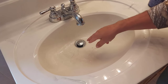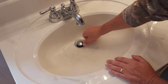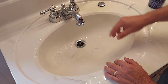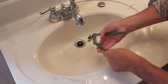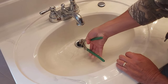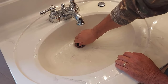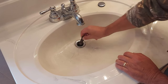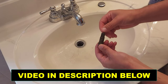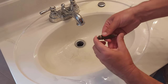Now with those methods I showed you how to unstick this pop-up drain stopper — it should work. Once you get it up, don't stop here because it's just going to keep happening. What I want you to do is turn this off — turn counterclockwise and you can turn that off. You're going to see this post in here; that's your drain. Reach down in there — if you just turn the top part it just turns, but if you reach down in there and give it a little squeeze, you can loosen it. It has threads and you can back it out. In my previous video — I'm going to leave a link to that at the end and in the description — I show you how to take this apart and lubricate all the inside so it doesn't get stuck so easy.